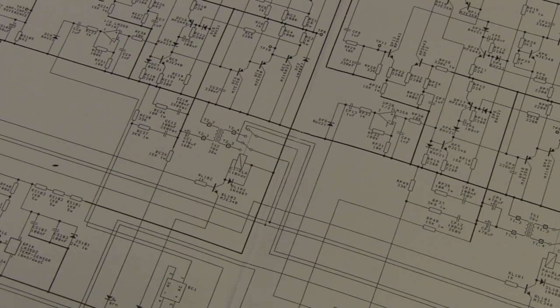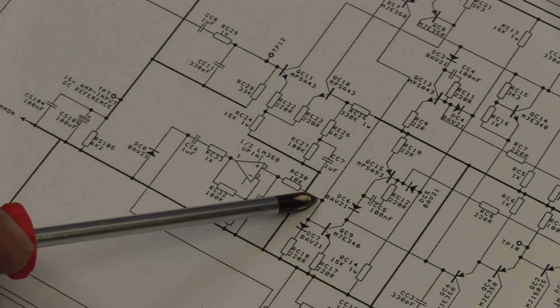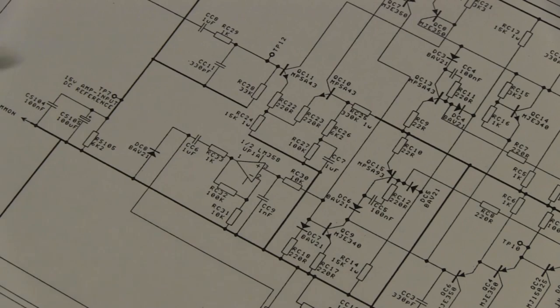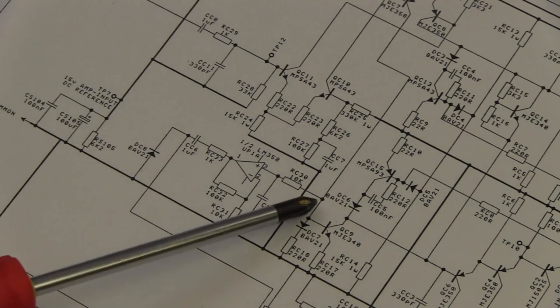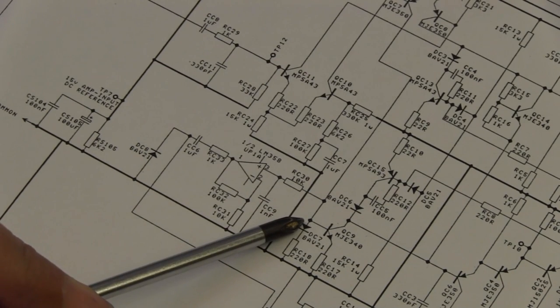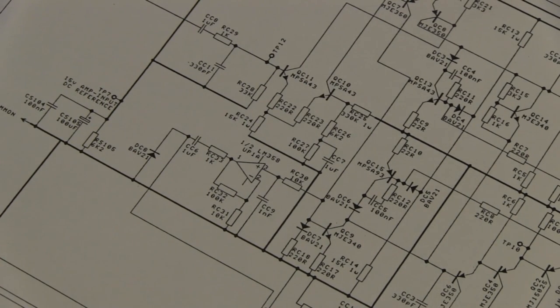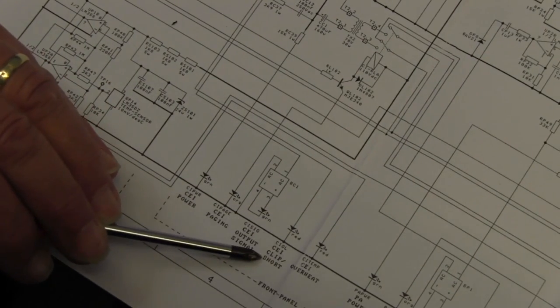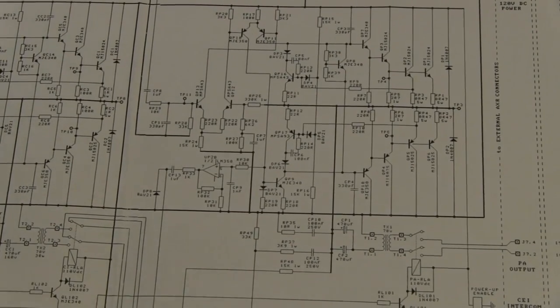One of the items that you might be interested in having a look at, though, is that op amp there. I was going to ask about that one, yes. Okay, it's having a sniff of signal going into the VAS, the voltage amplifier stage. Now, while ever the power amplifier is acting within closed loop conditions, there's going to be very, very little signal there. But as soon as it falls out of closed loop conditions, due to either clipping or short circuit limiting, those are the two main conditions, there's going to be a lot of signal appearing there. Put it through a rather crude half-wave rectifier, feed it down into that lead there, and you've got a short circuit indicator, clip lead. Bingo. Too easy. Duplicated over here. Too crude, too easy, too simple.